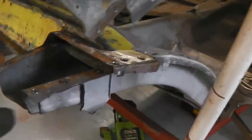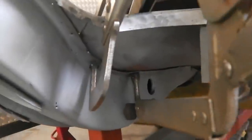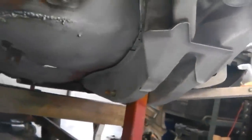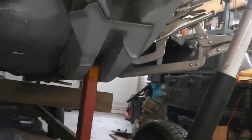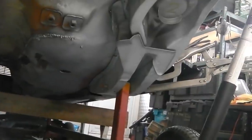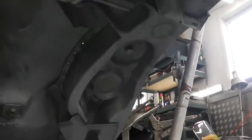We've trial fitted the leg, and other than a couple of mil gap there, which I'll just clamp up, and I've not got these on tight, it fits in nice. So we've obviously done the graft job correct. You can see where it just wanders a bit, but that's well within a bit of a bash, a tek screw, a weld, a plug and a clamp, and you're off. It's not like miles away. So that's good. And there was always a gap there. I remember when the floor pan went on, if you look back you can see that little gap. It's just the way the floor pan fits. Alright, so there's not a problem.